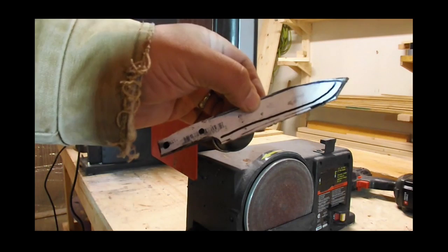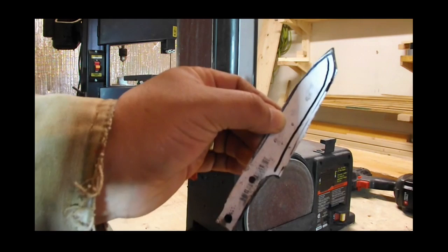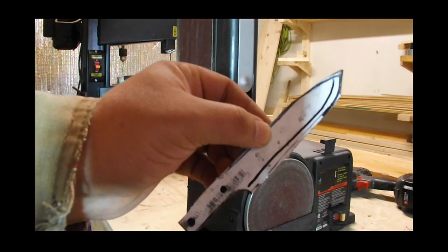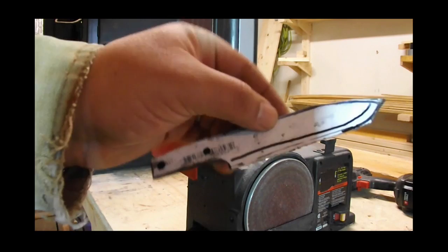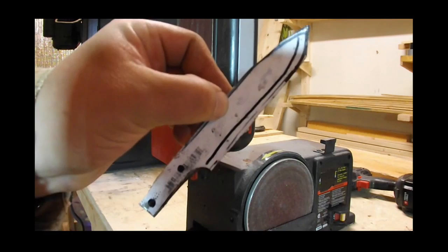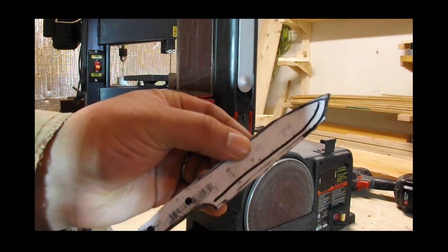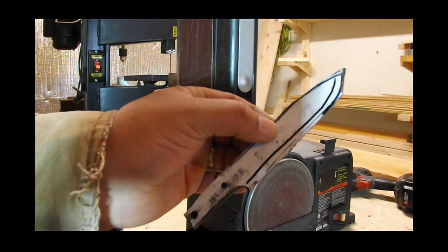So now we're starting with something like this. You've either gotten here through heating the metal up and working it with a file because it's simply too hard, or you've worked it down on an angle grinder or belt sander. I already tried working one of these down, which is why I know this is a very hard edge. While working it on the angle grinder, I made sure to just touch it for maybe five seconds, dip it in water, go back again, and keep working it like that.